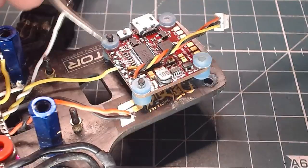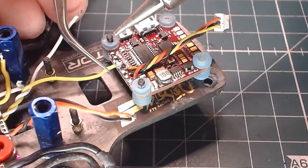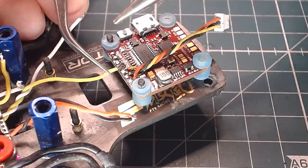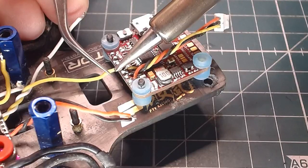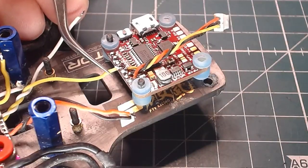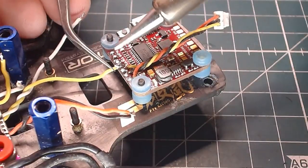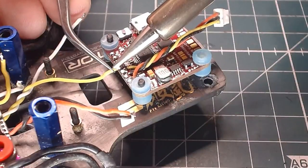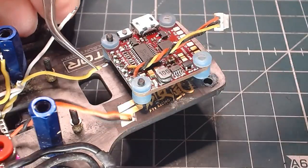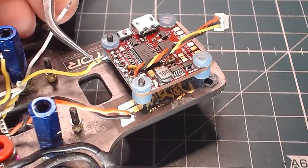Get this fixed. Oh God, that was not what I meant to do. My God, this thing gets hot. Holy shit balls. So it's doing that because the solder is going towards the heat because the pad isn't getting quite hot enough, because there's not enough flux on there. And like I said, it's not the end of the world, but I try to keep these glide builds really clean. And I also try to do things the right way for you guys.